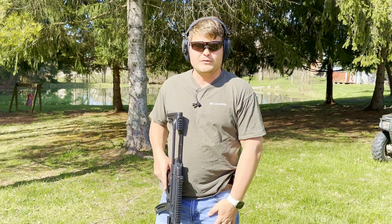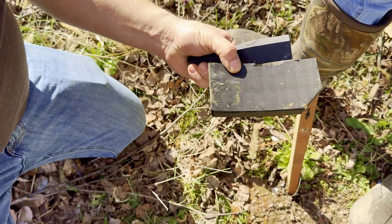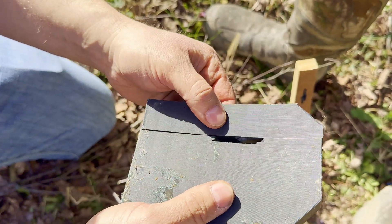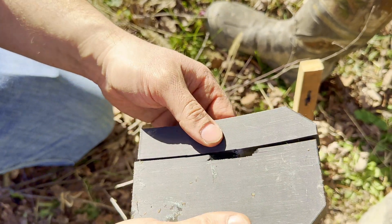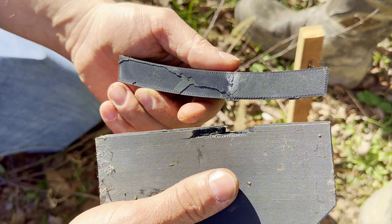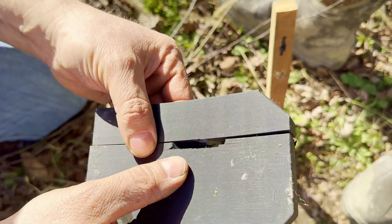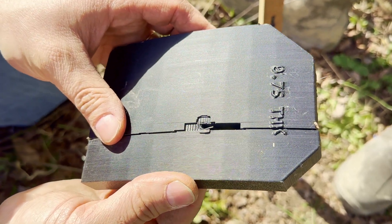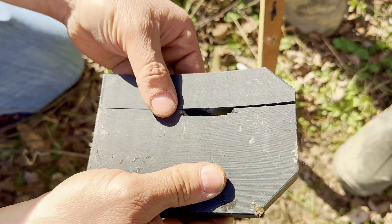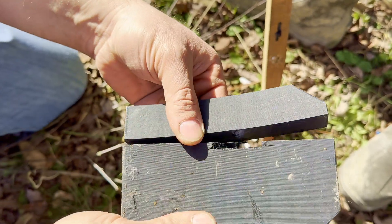On to the three-quarter inch carbon fiber PLA. That's one of the things with the Bambu printer — it's fast, but it doesn't allow for great layer adhesion. You don't have the same crater effect on the backside, but I think that's just because the part just split. The layer adhesion is not near as good. It almost seems like there's more porosity to these layers, so a hotter and slower print might be better. The fracture is right along the layer lines rather than the diametric crater pattern we saw with the other one.